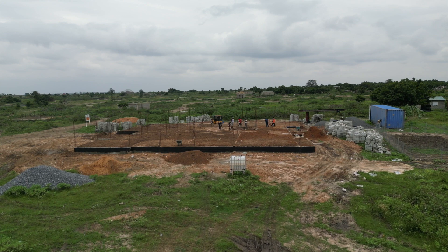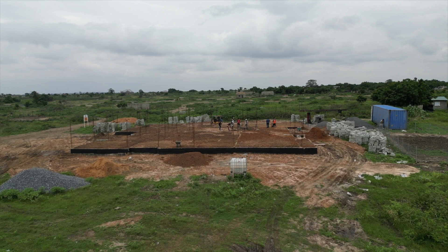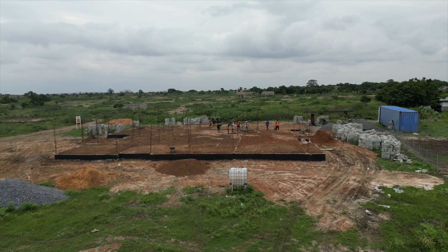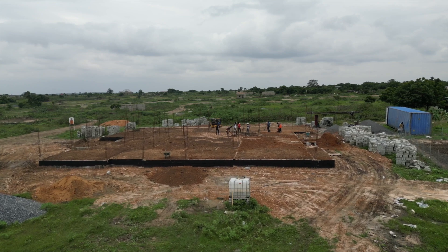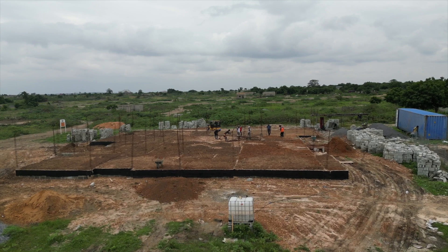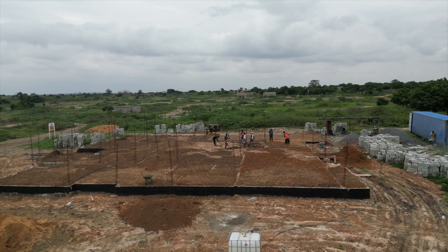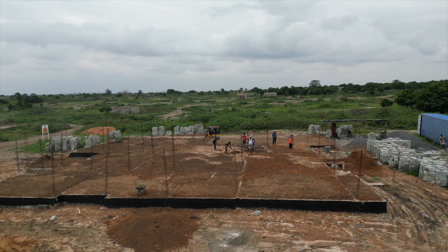So that's essentially what you're doing when you fill your foundation with laterite or soil and you compact it. The whole point of compacting is to push all that soil together, make it nice and solid and tight before you take any other steps. A badly compacted soil is only going to be a bad foundation for your home — it will prematurely cave in at some point.